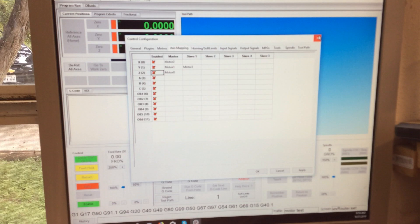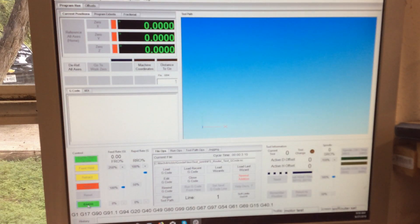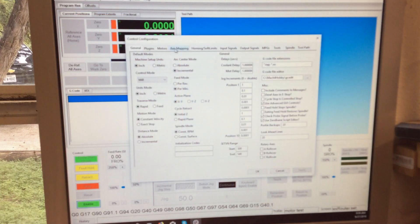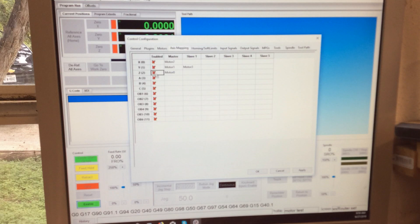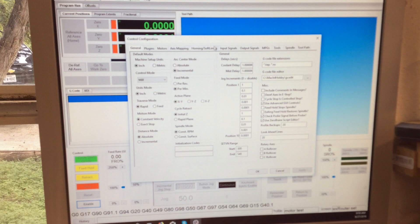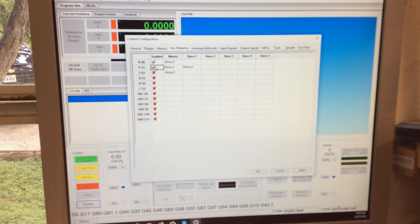These were already enabled, so I'm going to turn them off and show you what happens when you enable them. Come over to jogging. Let me uncheck them, click OK, and enable it. Now these are grayed out, so this is saying I don't have X, Y, and Z axes — we want to make sure those are enabled. They won't be on a true fresh profile.